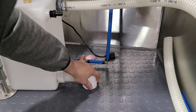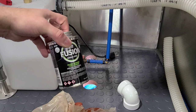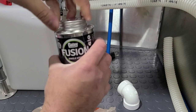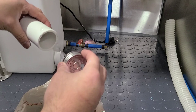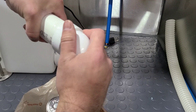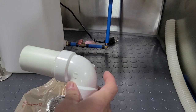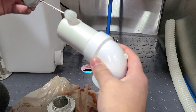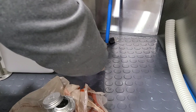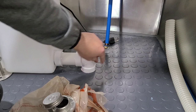There it is right there — there's our dry fit. We're just going to glue it together and that looks nice. We're going to keep using that same PVC one-step single-step PVC cement. Open that up, get the cement around our PVC — just like that, single step so it's just one application. Wait for it to dry and then insert it into the tank. We put some glue on this PVC and stack it right in there — there's your connection that goes down.